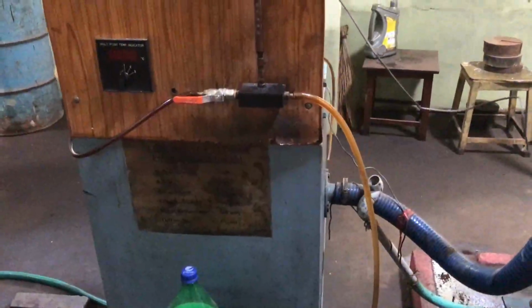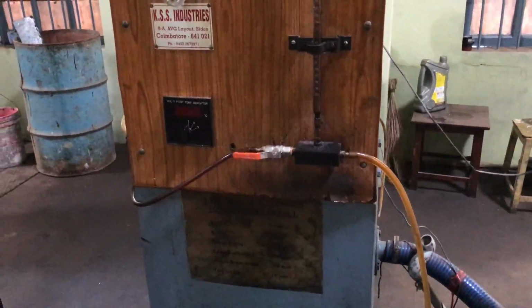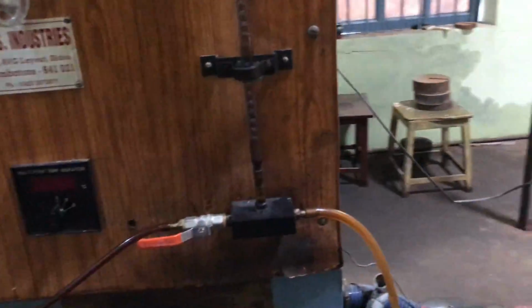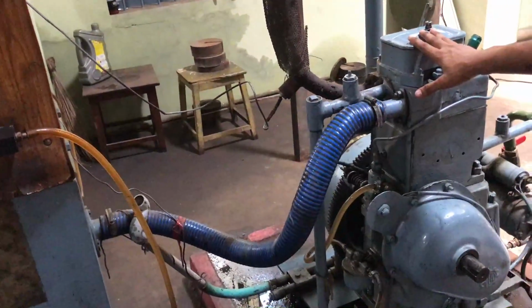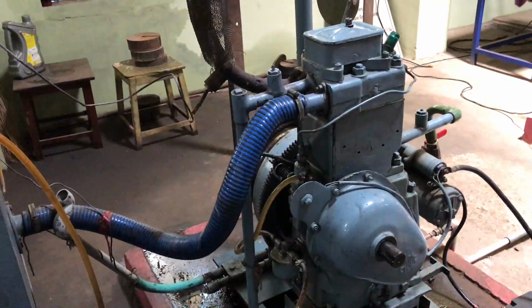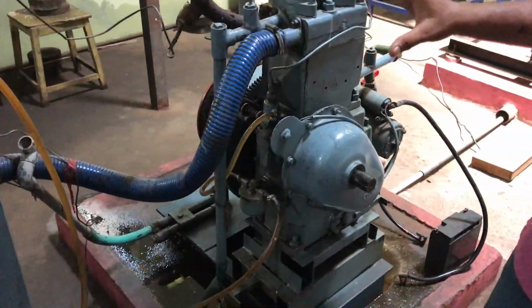After taking the initial test, initially under no load condition, first we will be closing the valve, and we will be taking the reading for 10 cc. You have to take care of RPM or something during that. The peculiarity of this particular engine is that the RPM is 1500, and that will be automatically adjusted, so we do not do anything.